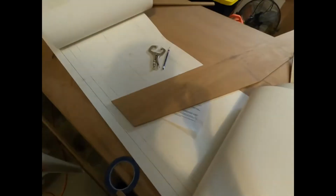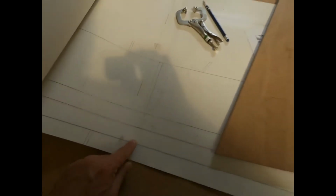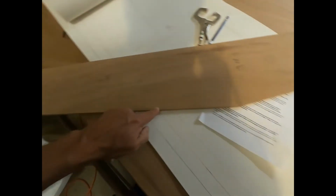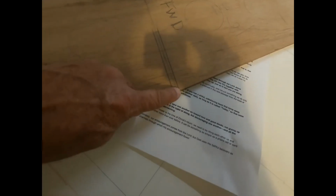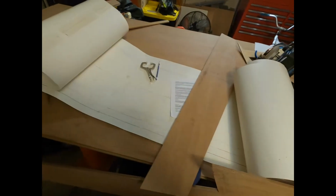And then same thing over here when taking the measurement between the upper surface, this point, and the bottom of the V. Again, that's a linear measurement, and we're not worried about this angle right here. All we're worried about is this linear measurement between the upper surface and the bottom of the V. Same thing, same principle, and I hope that clears things up.